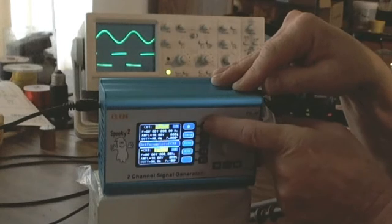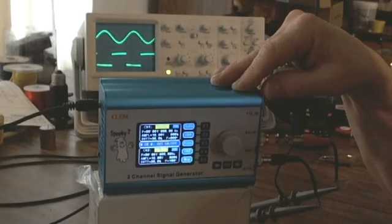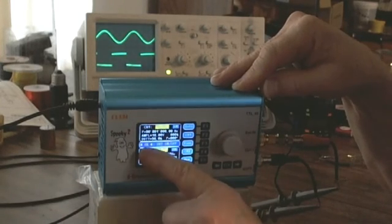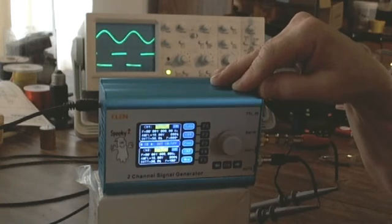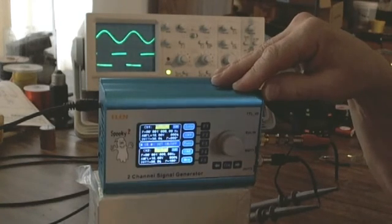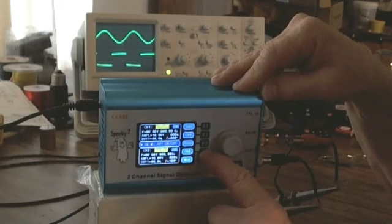I'm going to return by hitting the F1 key back to the OK window — one, two, three. I was really far down deep into that menu. I've got the OK here, so we're back at the reference window. I'm going to go to channel 2 and change that square wave back to a sine wave — F4 is channel 2.